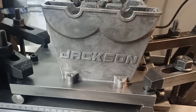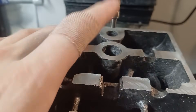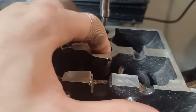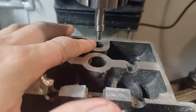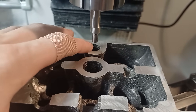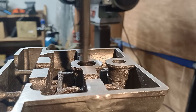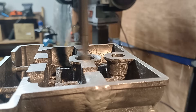Time has come — the good cylinder head is bolted into the milling machine on the sine plate. The first order of business is finding our zero points. I want to use the spark plug hole but because we've done welding there I can feel it on both sides and it's not going to be a good reference for finding the centre of a circle. We're going to use the water jacket outlet as a nice reference, find the centre of that hole, then move over and machine the spark plug hole internally round, and use that as reference for everything else on the cylinder head.